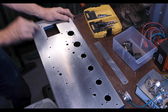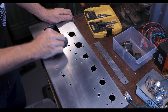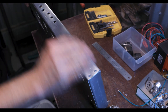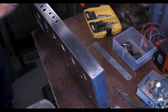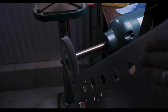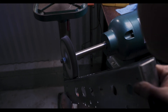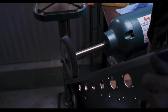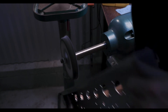Once I've put all my holes in the chassis and completely deburred it, I'll go through with quadruple-ought steel wool and rub the whole thing down. I go to a big deep sink, add a little soap and hot water, and do some wet sanding with the quadruple steel wool — it doesn't take very long. The trick is to move in one axis, side to side. Don't do circles — do long strokes. I have a high-speed metal buffer so I like to buff out the parts that are going to show. I'll use Neverdull, and the combination of Neverdull and the high-speed buffer usually works pretty well.